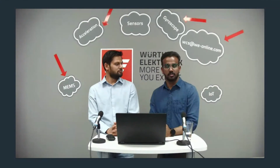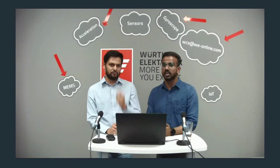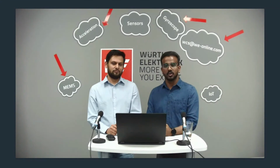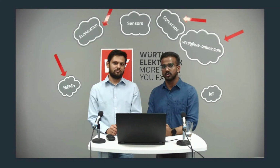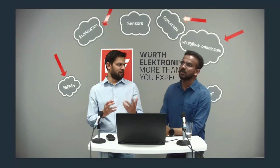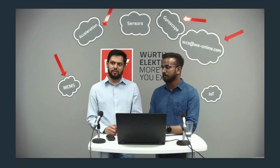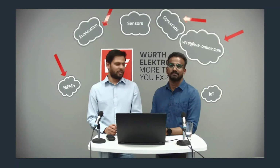If you're looking at the sensor, it doesn't have that much computation capability. It's capable of some functionalities like free fall and wake up, but it's not capable of complex functionalities like a Kalman filter or sensor fusion. So for this purpose, you would definitely need a microcontroller. Considering the technology that we have now, it's impossible to have this kind of algorithm inside the sensor. Maybe in the future you can include better processing power and edge computing. With edge computing, you can have these capabilities on the chip. Exactly. In the future, I think it would be possible. Right now, we don't support this.